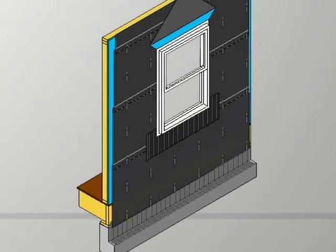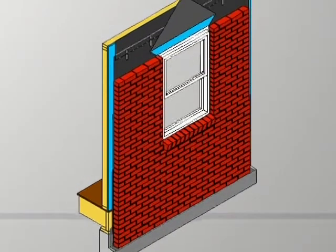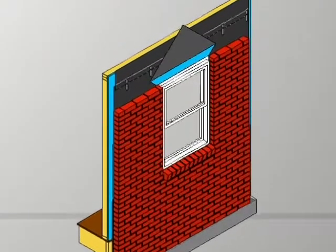Then all the mason has to do, after adding the proper amount of wall ties, is to begin laying the brick. Obviously he'd stop at sill height, put in a piece of flashing there — notice how it extends past the window a bit on each side — and there's even a small dam turned up in the head joints on each side of that opening. Then the sill is placed, and the brickwork can be carried up to the top of the window.